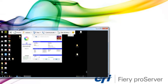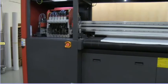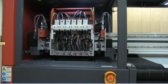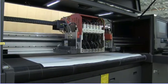Within Print Control Utility, open up your settings again and make a quick changeover to Roll Media. You're going to set your gap because this is clearly a much thinner substrate than the previously printed eighth-inch expanded PVC. Within Print Control Utility, you've selected Set Gap. The carriage raises to its highest available point, the small pneumatic pin engages — just like when running your rigid — the carriage drives over the surface of the material, lowers until the pin engages the surface, and at that point it will be at 1.5 millimeters away from the surface.